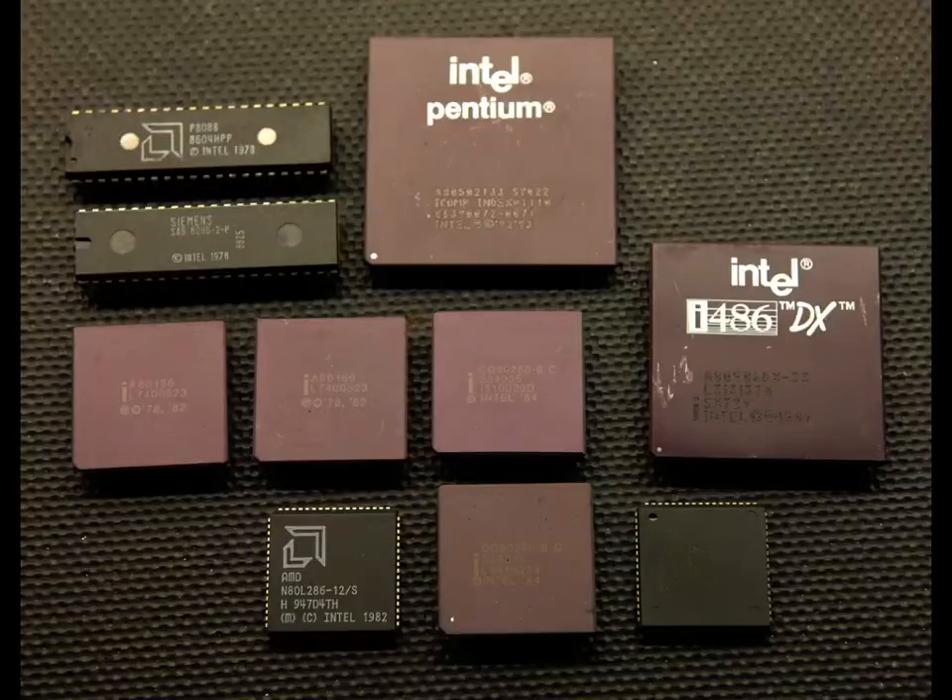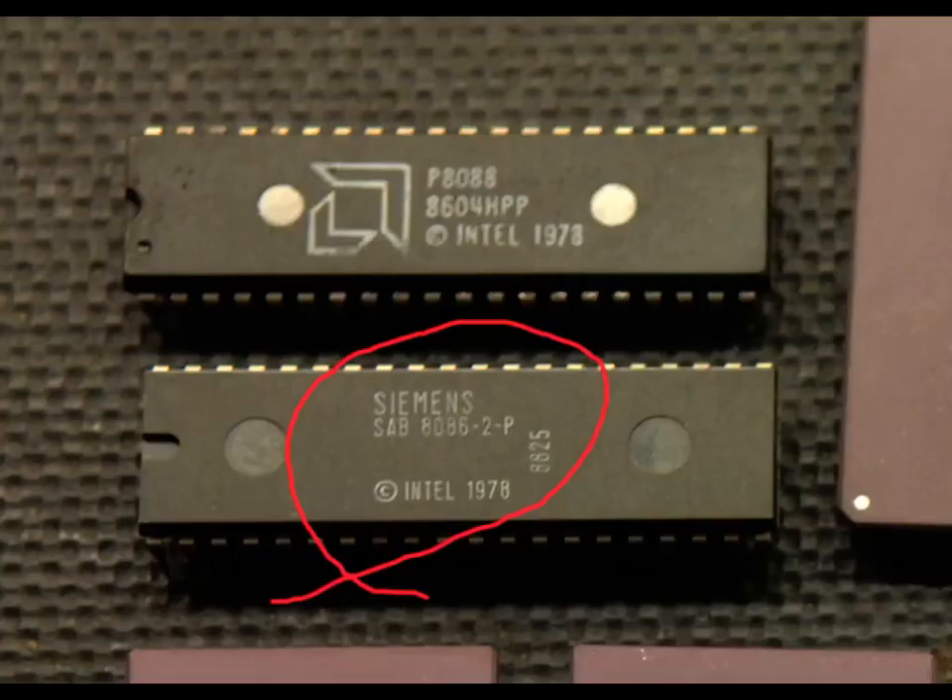Perhaps at this point it is worth mentioning that using one of these more complex devices is not recommended for a beginner starting out. I myself found the extra complexity of the early Intel 8088 didn't really offer anything much over the Z80. Hence I'd advise against a beginner starting out with this particular CPU, or for that matter with the Intel 80186, 286, 386, 486 and Pentium. Another processor to avoid would be the 8086. Don't confuse this with the 8-bit 8085, which is actually an excellent 8-bit processor for the beginner starting out.